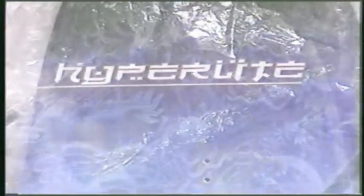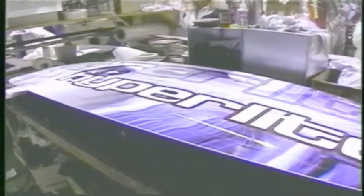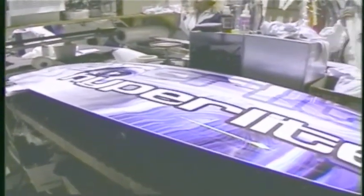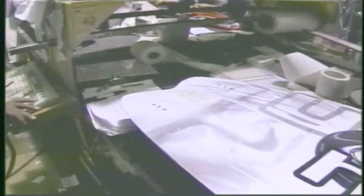So basically what we've done is: we've made the core, cut the glass, got the top sheet, added the resin, and put it all in the press. It went into that room, got cut out, came over here, got filed, and got inserted. Now it goes to QC. The board comes into this area all filed and pretty much ready to go. These guys will peel the tape off, make sure all the markings are figured out for all the processes, and make sure everybody did their job.